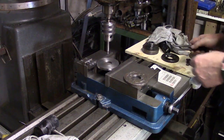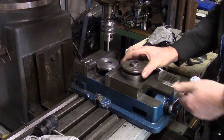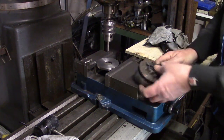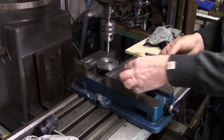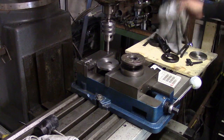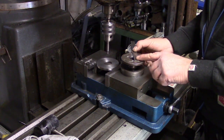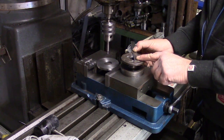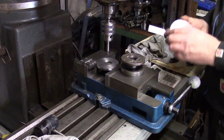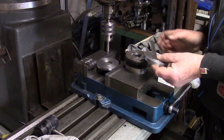One slight issue I have with these is that when that is on the hook, the original holes, I wouldn't be able to get this particular pin spanner in. Well, I can just, but it's catching the threads, if you can see that. So I think what we're going to have to do is make them a little bit wider. So we'll do this real scientifically. They're about 45mm apart, or 1¾ inches. So I think if I was to make them 2 inches apart, yeah, then that would be alright, wouldn't it?